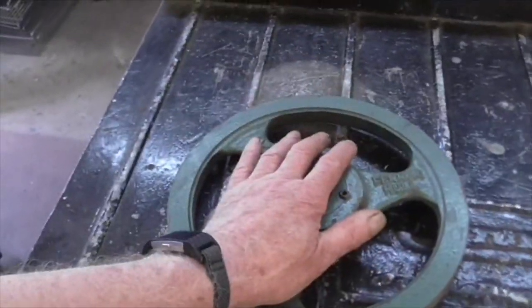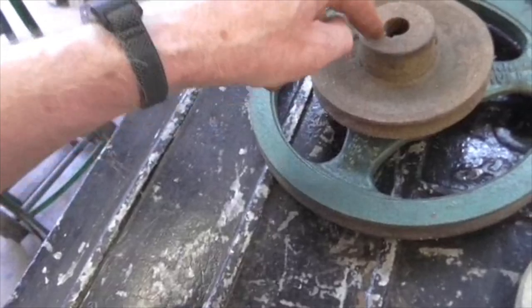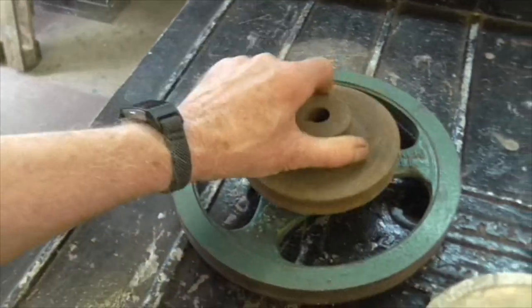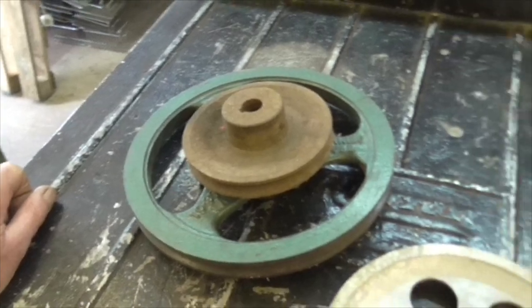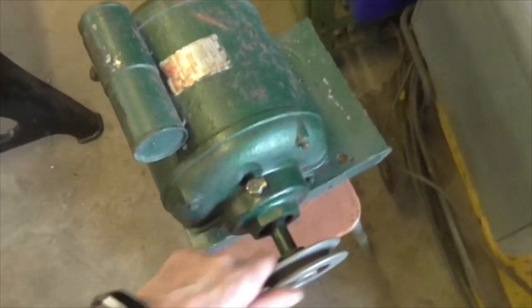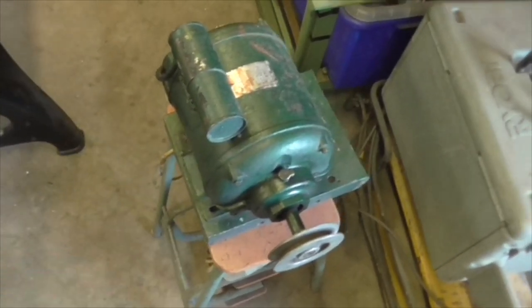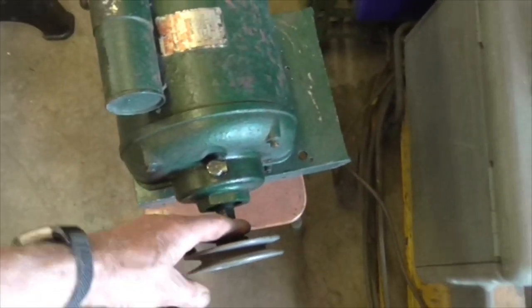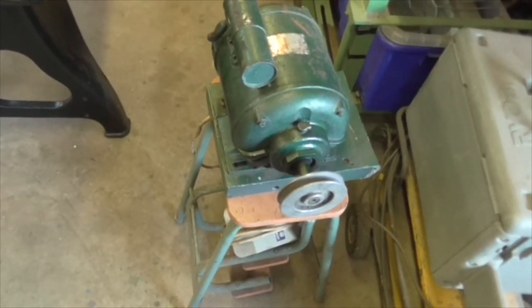So there's another cockle. I have found the main motor drive pulley, and the one I've got is very close to being half the size of that one — so that might be a pulley to stick in the lathe, turn out two-and-a-quarter inch, and affix to the shaft. That could solve that problem. As for the motor, I've probably got another pulley I can put alongside, or we can arrange for the motor to shift slightly sideways to accommodate the different position of the V-belt. I could move that pulley along or put another pulley on the outside of it.